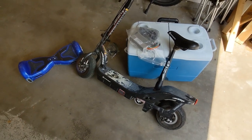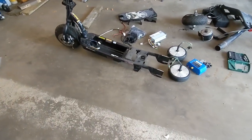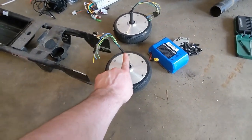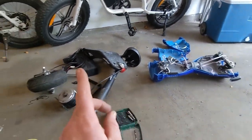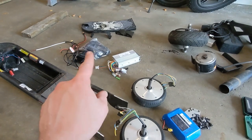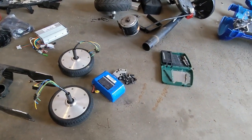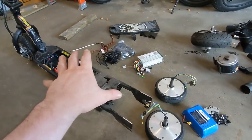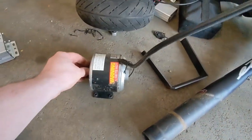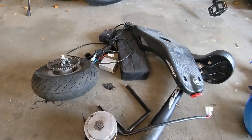Next step is just to tear this stuff down and build it into the shape of a cooler scooter. Here's what the scooter looks like with everything removed that I don't need. I think I'm going to hang on to the seat mount for now. And here are the brushless hub motors, leftover hoverboard parts, leftover scooter parts, the new speed controller, and throttle. I'm probably going to keep the footrest, reuse that, plus the charger, charge ports, and battery plugs I cut off the old hoverboard motherboard. Here's the hoverboard battery — so these are the parts I'm combining to make something. This will probably all end up in the trash: the old lead-acid battery, the old junk motor with a bent shaft — brushed, yucky — and the baby little speed controller from the original scooter, plus the old lead-acid batteries inside, which are garbage after about two years.